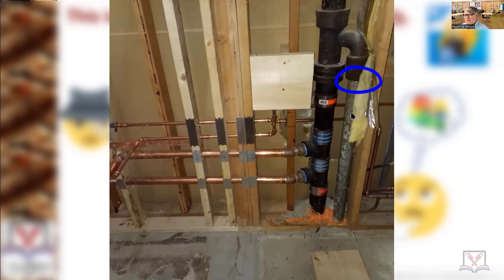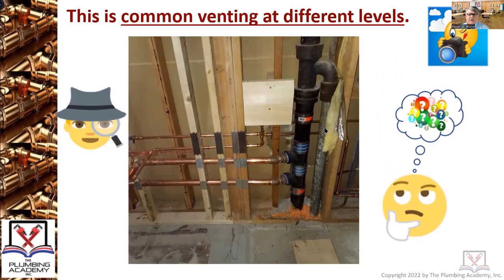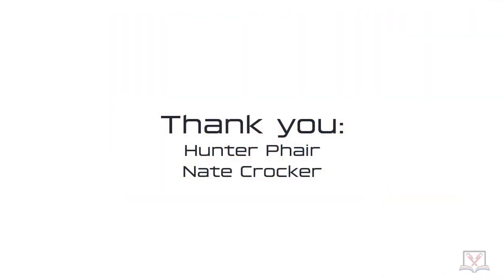A nice joint runner, all oiled up — not a dry one. You actually soak it in oil, because if you didn't know, you buy those joint runners at the supply house. For anyone who knows what lead is, you've got to soak it in oil or there's no way you're pouring that joint. If that joint runner has not been soaked in a five-gallon bucket of motor oil from doing an oil change on your car — that's craftsmanship right there.